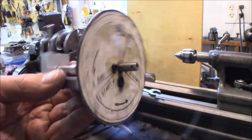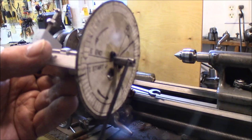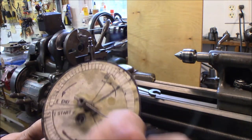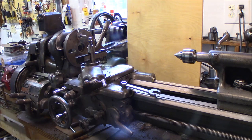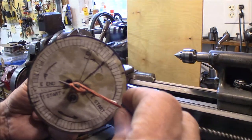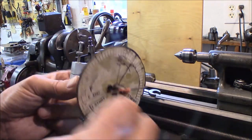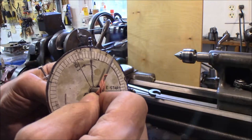You make your camshaft a little bit longer than you need it and drill a little 1/16-inch hole, and that hole becomes the hole for the pointer. It's supposed to be a tight fit — you can Loctite or super glue it in there, but just for the purposes of this demo I'm going to rubber band it in there. It has to be able to move because when you get to your live center you're going to bump into it, and you have to move it for a couple of iterations.